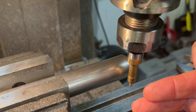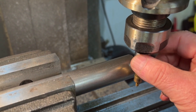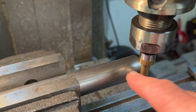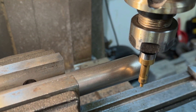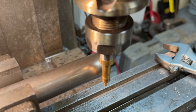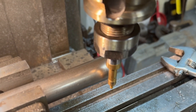As I come in on the steel and it starts to rotate, it'll centralize itself, and then as I go in a bit further, just as I touch the edge completely on the centerline of the wobbler, it will kick off to the edge. Watch what happens when I do this.